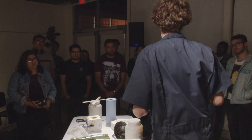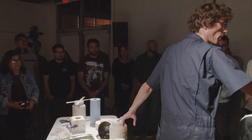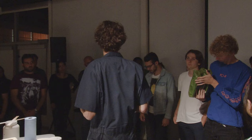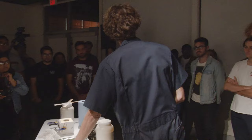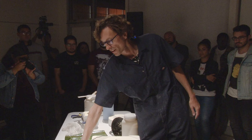And then if you get plaster in here, and you cast and you've got a little flake of plaster in there, it blows out in the kiln because it has a different rate of expansion within the kiln. But one of the amazing things about clay is, do you mind grabbing that green thing at the end of the table over there? This one's probably the heaviest one that I brought with me. If you guys want to pass that around, that's the module from the ceramic house. It's heavy, but it's hollow. And in terms of all the ways that you could produce building components, it's a super efficient process, super low carbon footprint. There is a significant carbon footprint when you fire, right? The energy comes from somewhere, right? But compared to concrete, steel, any of the other materials that we build with typically, this has a lower carbon footprint. And there's no waste, right? This would give me my waste for the day, this kind of stuff right here. So it's not like that's going into landfill and causing huge problems.